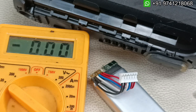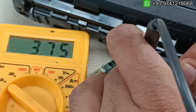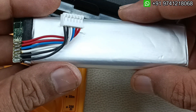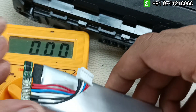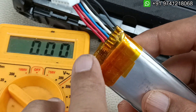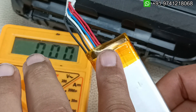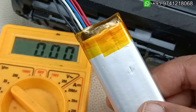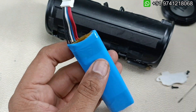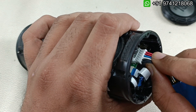I have installed the battery - minus to minus and plus to plus. We will get the voltage at the BMS now. I've set the multimeter to 20V DC. You can see 3.76 volts is already there. Now I have to pack this battery using heat shrink. I've used heat-resistant tape on the BMS and battery. Now I'm inserting the heat shrink to make a proper battery pack.